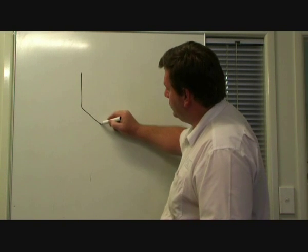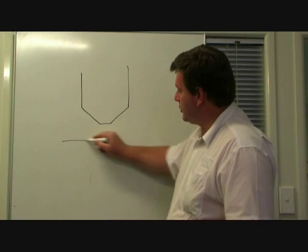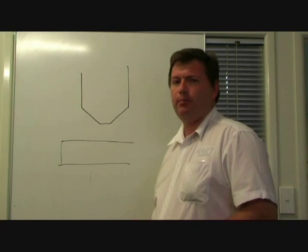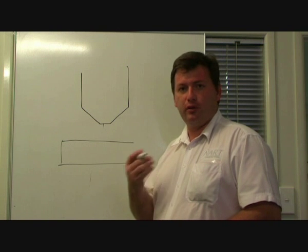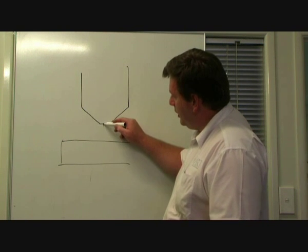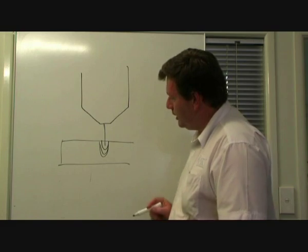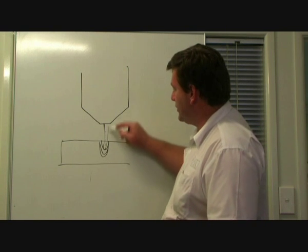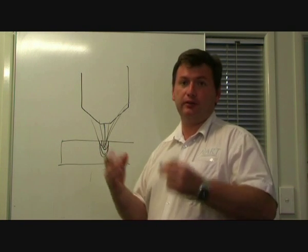I'll just draw the outside of the torch, which looks something like this. Most of the time you're trying to pierce through the middle of a piece of material. It is possible to pierce at the edge, but only when your parts are aligned along that edge. For the most part, you're wanting to pierce a hole through the middle of a piece of material — a blind hole. On thin material it's not really a problem, but on thicker material, what you're actually asking the machine to do is to erode a hole through the material. You can imagine that material is very hot and it has to go somewhere. The only place for it to go is back up around the torch, and you'll see when you're piercing thick material, especially, virtually a volcano of molten metal coming out.